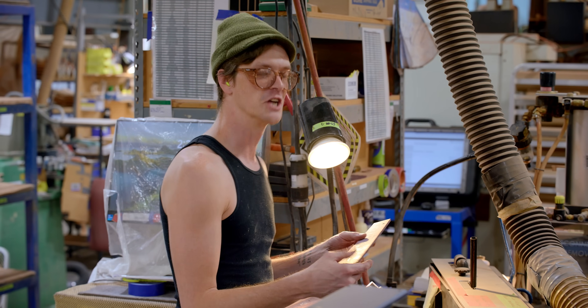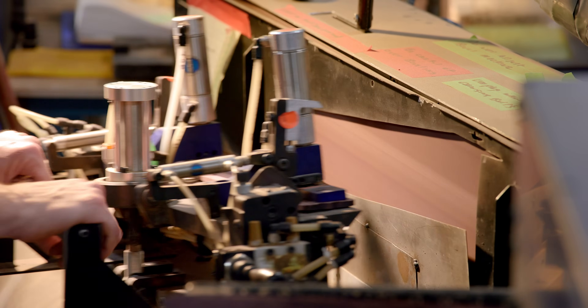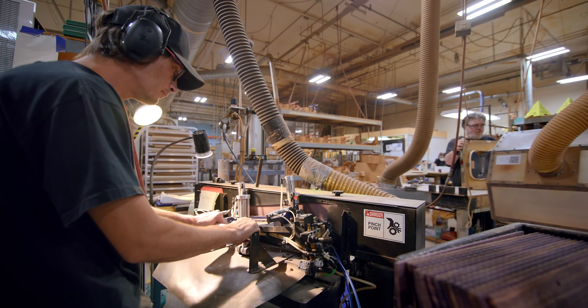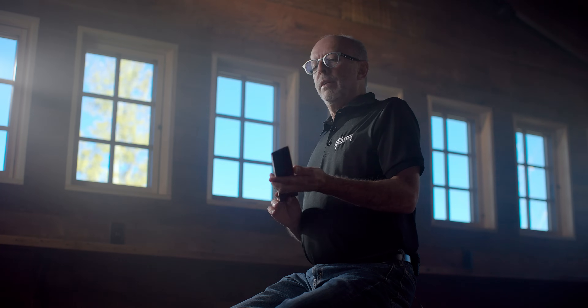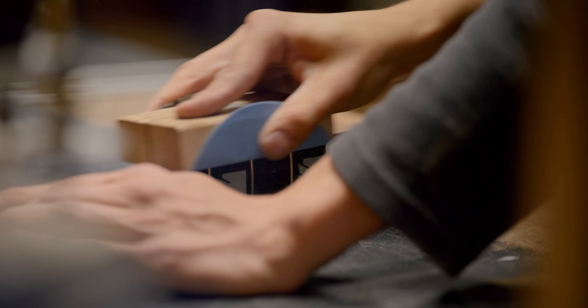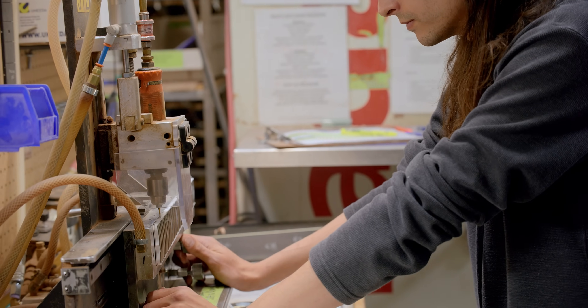They go in and make that adjustment. This machine is a giant belt sander. After we install all of the frets, the ends are sticking out. We sand it flush, and then it flips up at a 45-degree angle and puts a bevel on there so when you're playing it's not cutting your fingers. When playing any guitar, the actual inlays which mark the various frets are not really visible to the player because of the position you're holding it. So side dot markers are installed at this point.